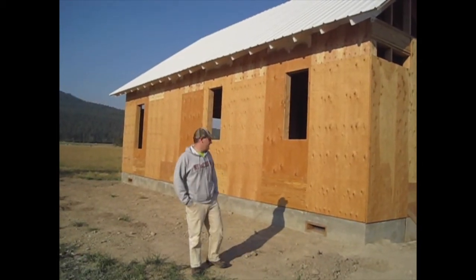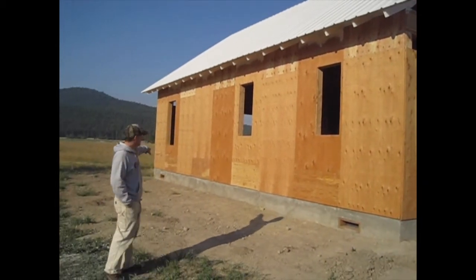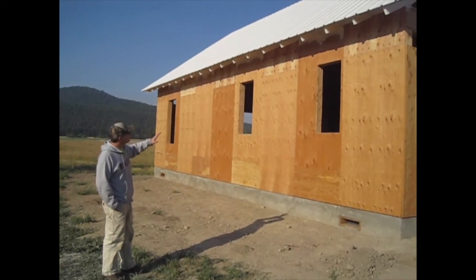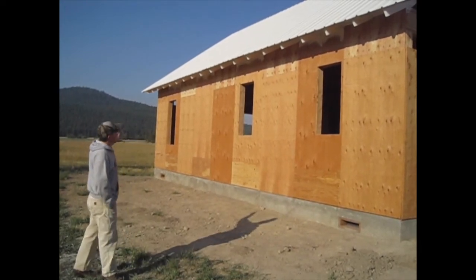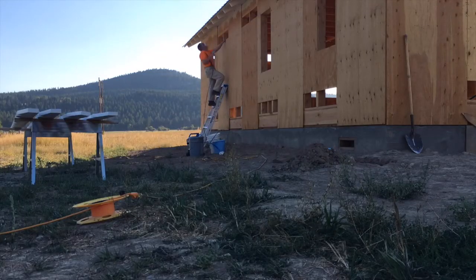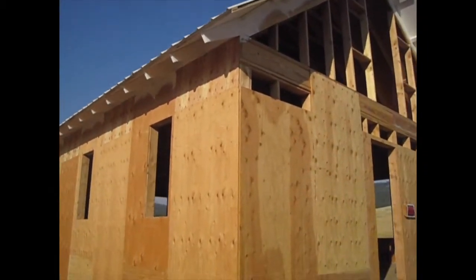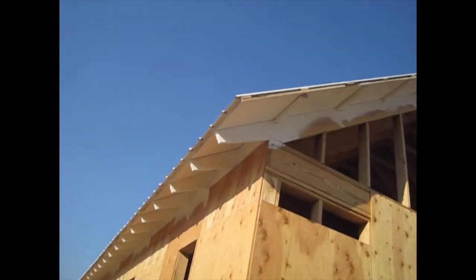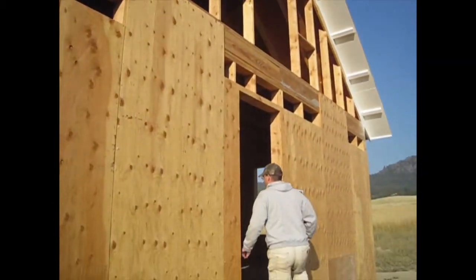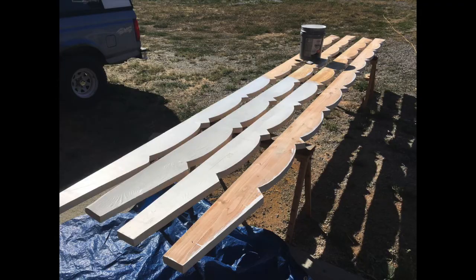So this is where we're at: we went ahead and filled in the spaces where the sheathing was missing, staggering the sheets. That's been all filled in. We've cut out the windows, we went ahead and painted the rafter tails and the eaves so we wouldn't have to worry about that once we get the siding up. And then we also cut out the barge rafters, which we have staged inside here.